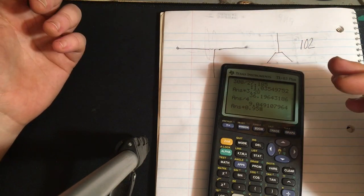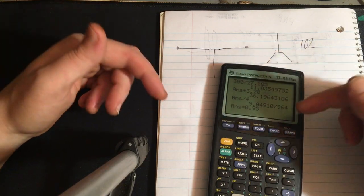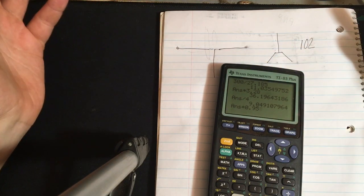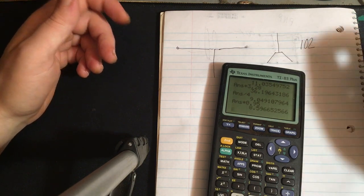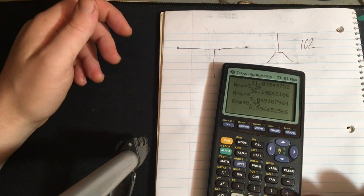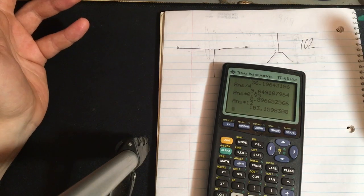If you make your velocity factor any lower than this and it happens to be higher, well, you've got to extend your antenna some. But if you calculate it a little too high, that's all right. You just shorten your antenna. So 0.95 is what I always go to. That's 8.59 feet. So what's that in inches? Well, times 12, enter, 103 inches.